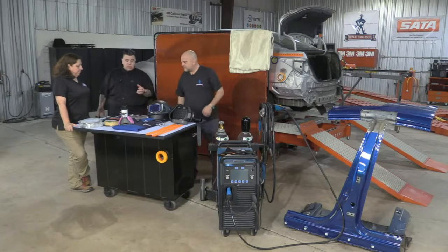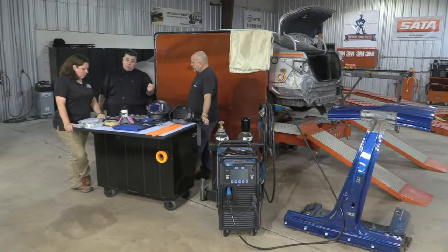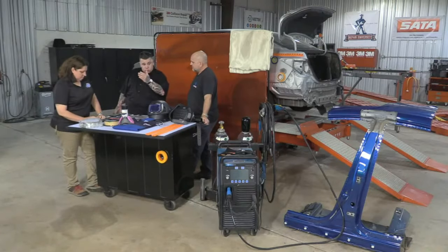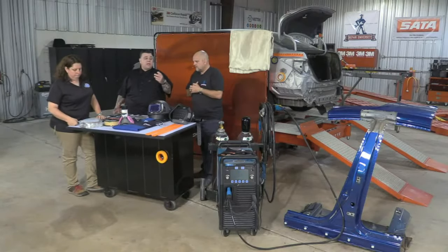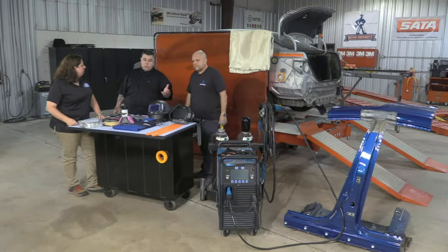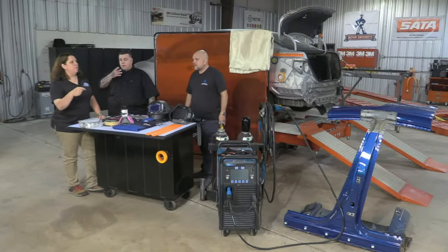6 millimeters in some cases. It depends on how much material you're welding through, what type of material you're welding through. If you're doing silicone bronze or MIG brazing versus MAG welding, there's a lot of parameters out there on just a plug weld hole size, because I can't get access to both sides. And once again, to stress this, we don't have a resistance welder here, but you never do a single-sided spot weld. You're not good enough to make up for science.